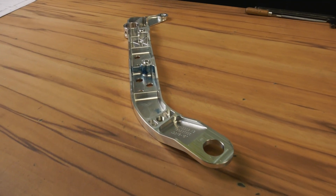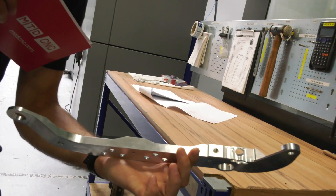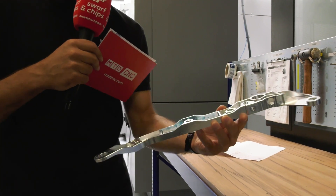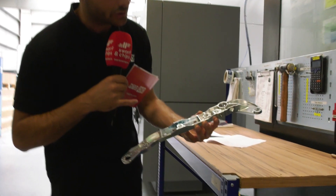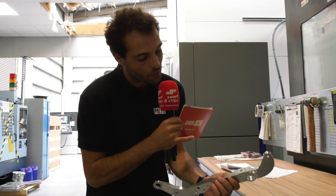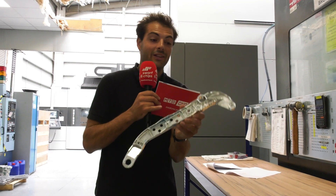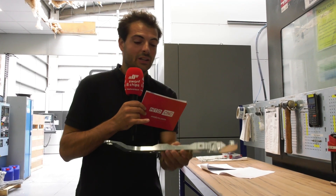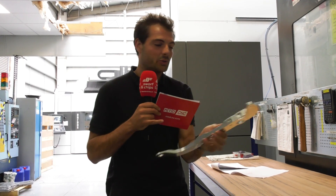Moving on from three-axis parts, there are these absolutely lovely five-axis — or slightly five-axis — parts. They've got a few holes on the side, beautiful prismatic parts all about the weight-saving pockets, the little rads, and scanning these little ramps and radii. There are so many features on the front you could do on a three-axis machine, but only four or five features on the side require five-axis. Rather than doing setup one, two, three, four separately — which would take so much more time — five-axis handles it all in one hit.